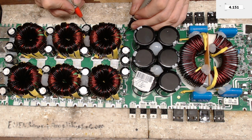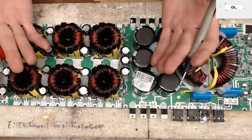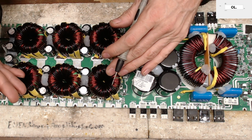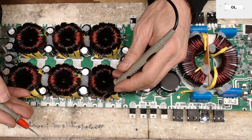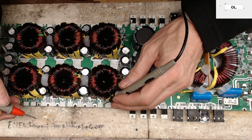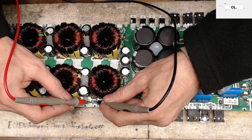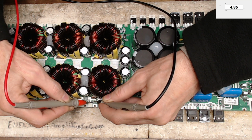you'll see that I have my 4.1K pull down to ground, which is what it's supposed to be, because we have 4.7K resistors pulling the gate signal back to ground. I have to apologize. I assumed that the 1K was correct, but it's impossible for it to be correct. It must be early. I'm used to 1K pull downs, and I saw the 1K. I'm like, oh, it's correct. Well, it's not. The pull down value you should read on your gates to ground is your pull down value, and then between your pull down resistor to the gate pad, you should read the value of the gate resistor.